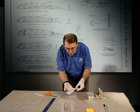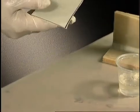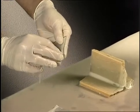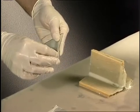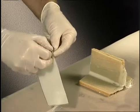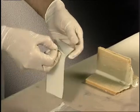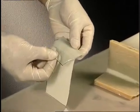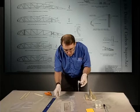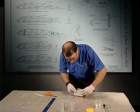So now we have a wetted piece of glass — the fiberglass and resin encased between two pieces of plastic. The next step is to carefully peel off one side of the plastic. This is the tough part because the plastic does tend to want to stick — the resin's a bit sticky. If you have tweezers, that will make it a lot easier. You can see I'm peeling away one piece of plastic to expose the wet fabric underneath, and we can then take that wetted-out fabric and apply it to our joint.